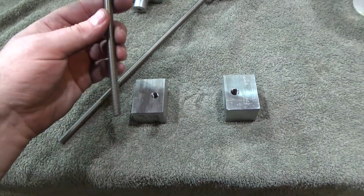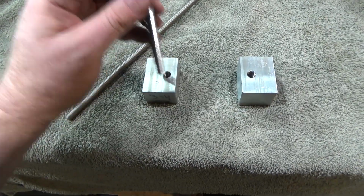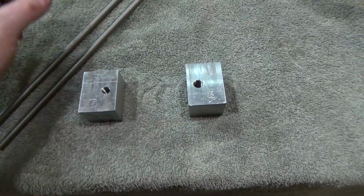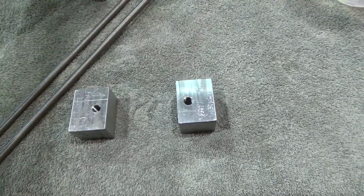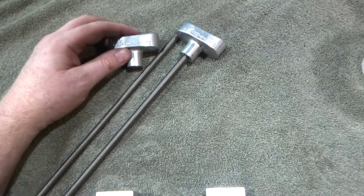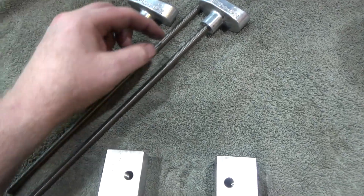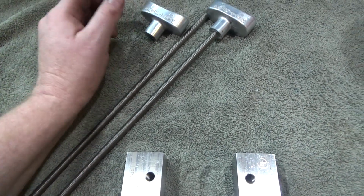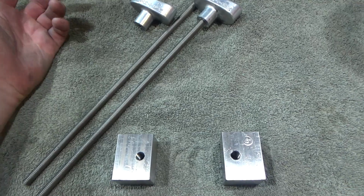And these guys, these threaded rods, 316 stainless, screw into here. This gets epoxied under the aluminum angle. And then there's a crossbar we don't have the piece for because we don't know the exact length yet. So these guys thread down and push down on the crossbar. It's going to be an aluminum crossbar going across all three batteries, and you'll tighten it to get a little bit of flex. And that's it. Should be good to go.